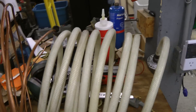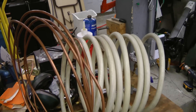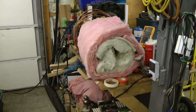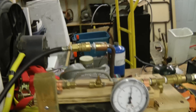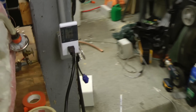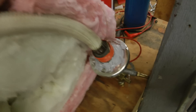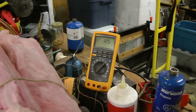I've got a garden hose around this to make a relatively small recuperator. I'm going to pull some insulation off the wall over there, then we can cover this and see what kind of cooling it will produce. That's covered with insulation now. I've got the compressor running, stable at around 200 psi, connected up to the shop air compressor to get some boost and more air flow. Let's put the bottle on this to see if it starts to cool down. Put a thermocouple on the entrance to the recuperator — just gives a good indication of the temperature.